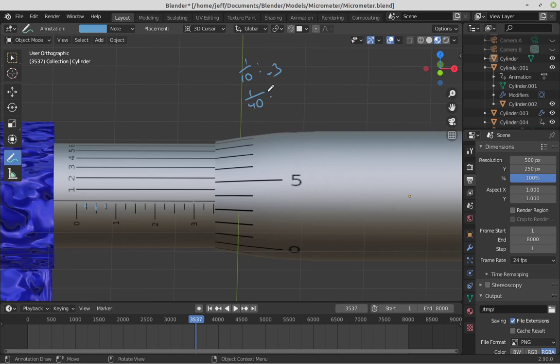Instead of writing it as a number of 40ths, it's actually easier to look at it as decimals, because ultimately we're going to want all these as decimals. So the decimals there would be 0.025 for 1/40th, 0.050 for 2/40ths, and 0.075 for 3/40ths. The way you can remember these is, notice this is 1/4, 2/4, 3/4, except we're adding on the 0 in front of that. So this particular reading that I'm looking at right here, we're past the second hash mark, the second 40th there. So this would be 0.050. That's what my reading would be for the 40th scale.